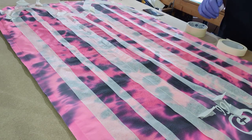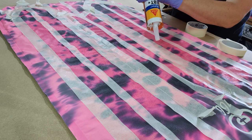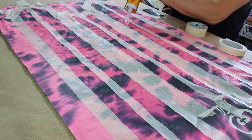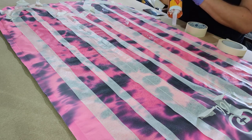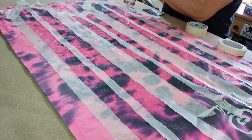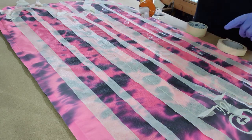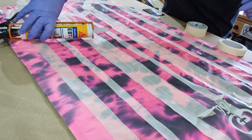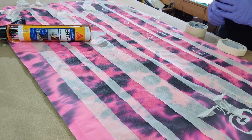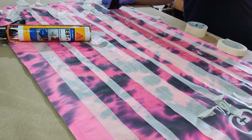I'm going to use the roller for this job. Apply some blobs just along the length like that. We're not doing a full grip of the mat because it's already gripped — we're just topping it up, so we don't need tons. Once you've got it on, just a little tip: make sure the end of the nozzle is put down somewhere where if it drips, it's dripping onto something it's allowed to drip onto.